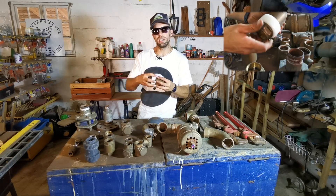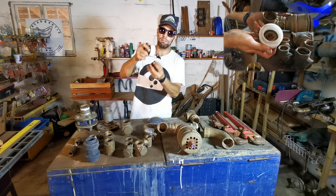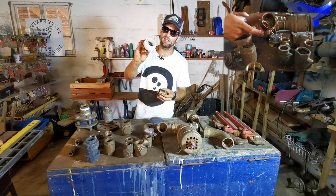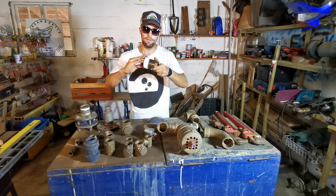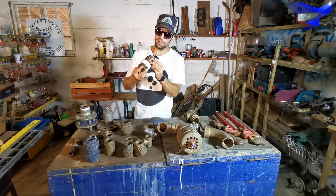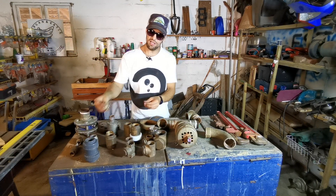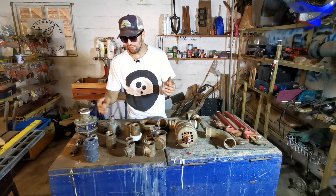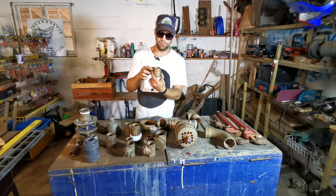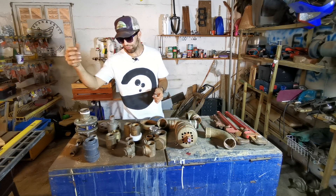We took that a bit further — we thought we could increase the water volume in our valve, so we had a piece of vinyl pipe fabricated to extend the length of our spring check valve. This doesn't work either. A number of the poppets from inside these spring check valves have popped out because their guides are broken. I've used cheap valves — this one isn't even round anymore.